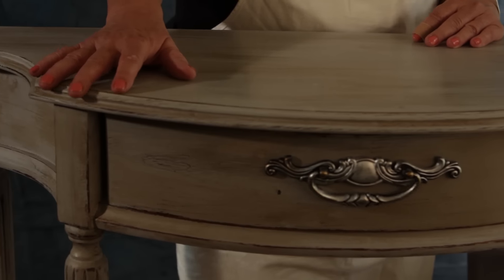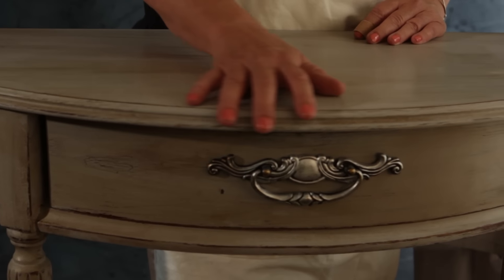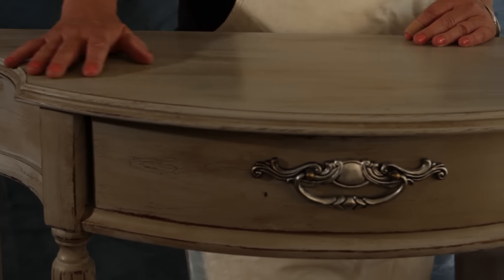Now let's talk about the table. This is a relatively new and inexpensive table with a slick factory finish, so I sanded it down lightly just to give it a little tooth. One quick note about sanding: if you're sanding an old piece, you have to assume the paint is lead, and you must be very careful. Wear a mask and be careful with how you dispose of the sawdust. On this table, I used two coats of smoke paint, then distressed it, and then used clear and dark wax to seal it.